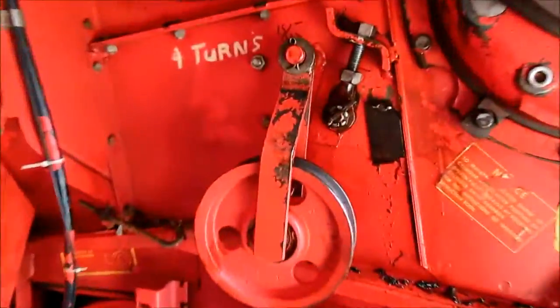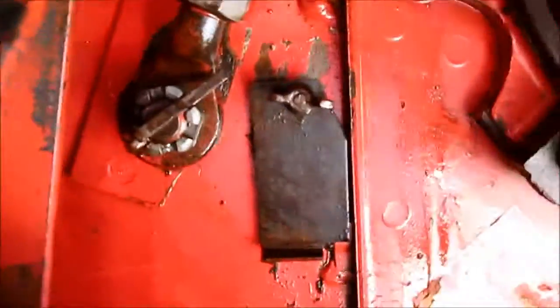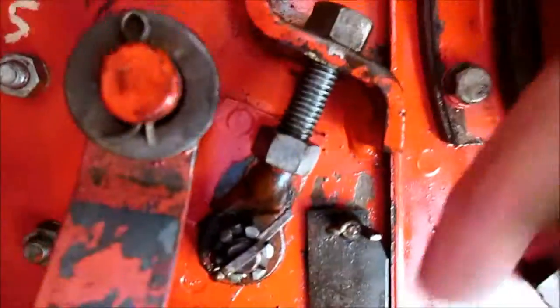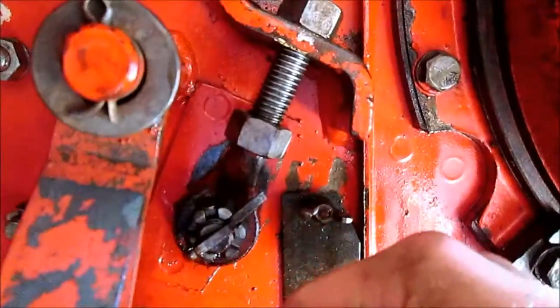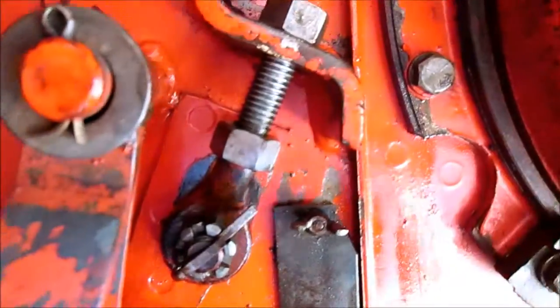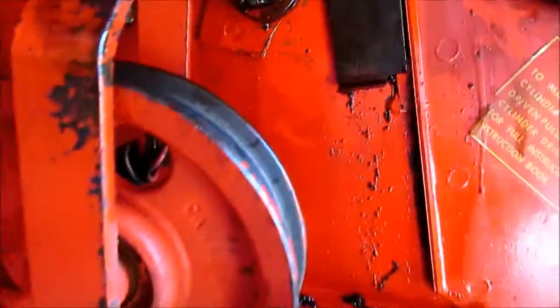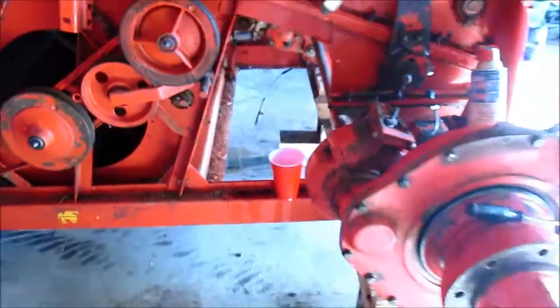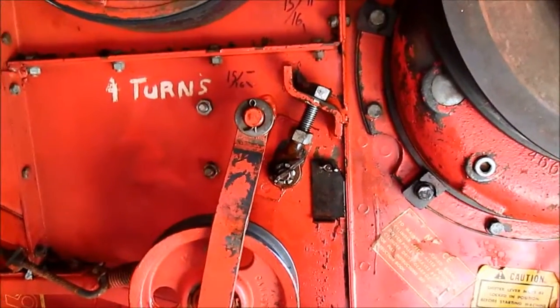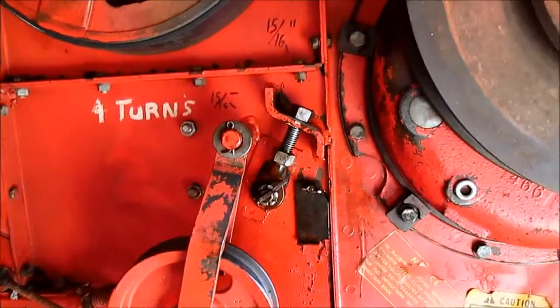And then this side we actually got so free that I didn't run this nut up to push the cylinder down. It actually just fell with loosening this top nut. It just fell all the way to the bottom. That's what you want, because when the tire's on here, you're laying under there and it's not fun. You're skinning your knuckles, it's hot and normally dirty.